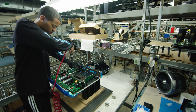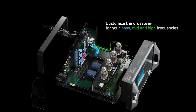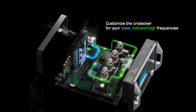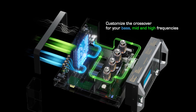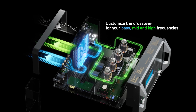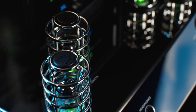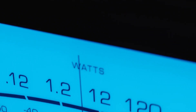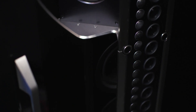With a hybrid drive amplifier, all of this is built on one chassis and it allows you to customize the crossover — where you want the bass frequencies to go to the solid-state and where you want the mids and highs to go to the upper end of the loudspeaker. You can use the vacuum tube amp to get the warm tonal characteristics of vacuum tubes, but you still get the punch and high headroom of a solid-state amplifier for your woofers and low frequencies.